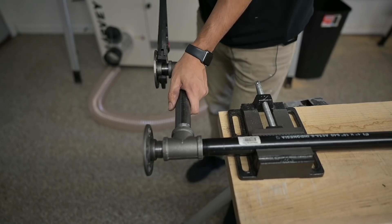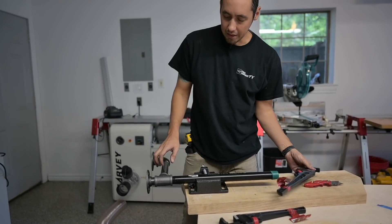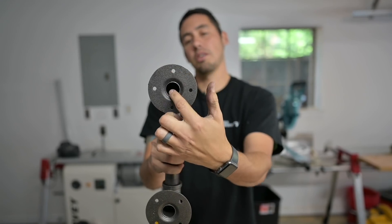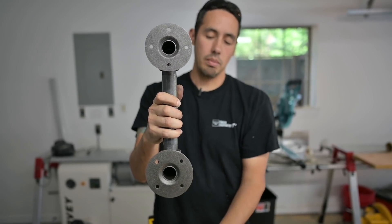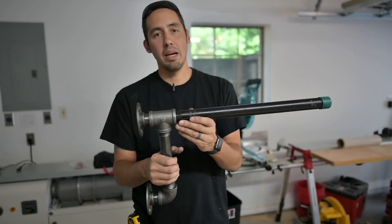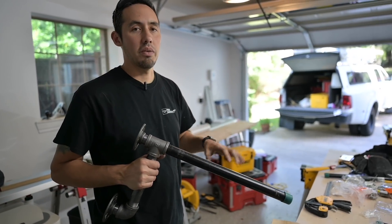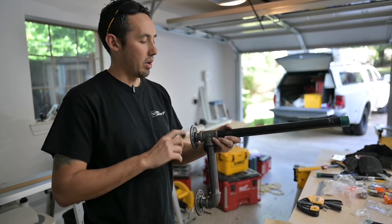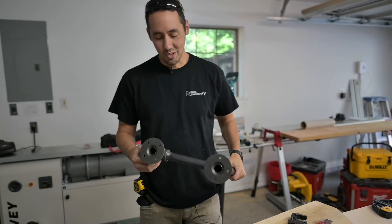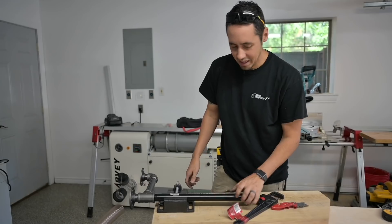Let me see if I can tighten these up a little bit. Now we've got to make sure that as we look at this thing, I've got a screw there and there. So this one actually looks pretty good. The bottom one needs to rotate in one of the other directions. This is going to be a heavy-duty one-inch pipe shelf. We're going to spray this with the stuff you spray for DIY bed liners — it's called Line-X or whatever. We're going to spray these with that, so it's kind of like a grip for the lumber to sit up there. It's actually looking pretty cool, especially when it's Line-Xed. It's going to be awesome.